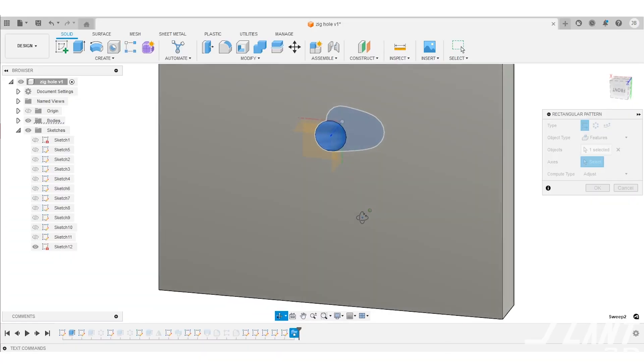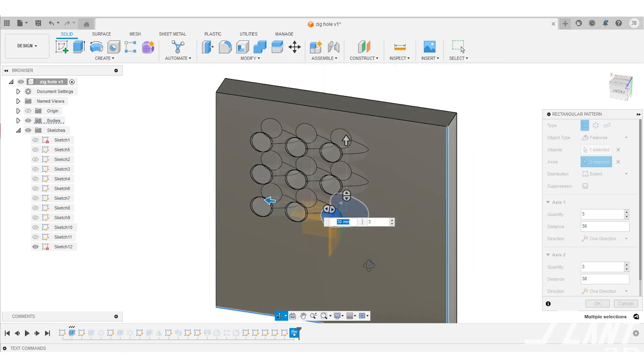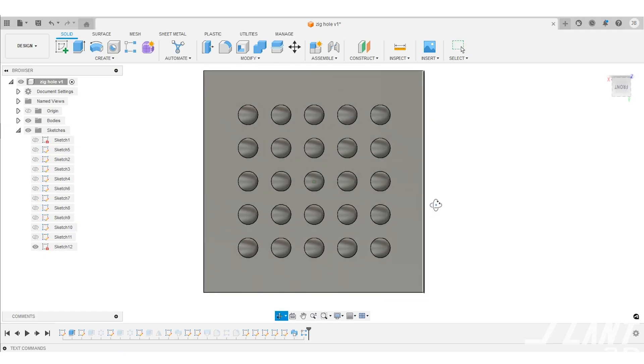You can take that idea even further with 3D printing — the air path doesn't have to go straight through. You can actually have it curve through the part. This fan vent you cannot see through at all, because these holes make an S-turn through the part. Each hole takes a U-turn through the center of the piece, totally blocking any light pass-through. This design does require a thicker plate than a traditional slot or hole, because you need enough thickness to accommodate that curve without intersecting with adjacent tubes.